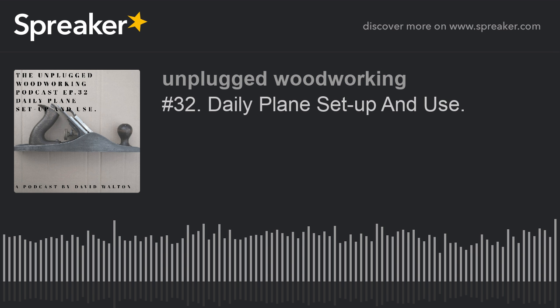and so on and so forth, keep on working your way, taking those corners off. But after I've taken the first big shot, the first chamfer, I will retract the iron a little bit, get rid of the two I've just created, and I'll retract the iron a little bit more, and then I pretty much work like that. I pretty much just keep going like that. Towards the end, I'll probably retract the blade quite a bit, so it's just a really fine shaving.